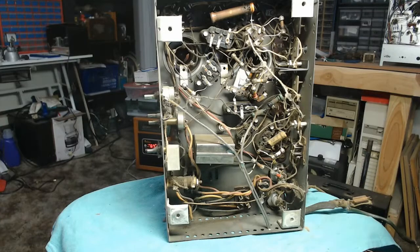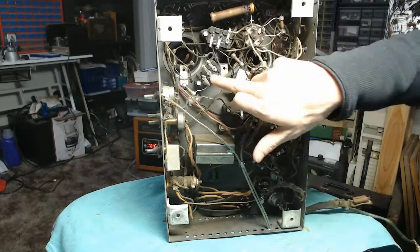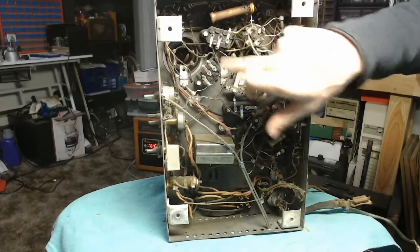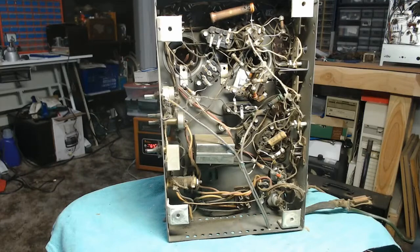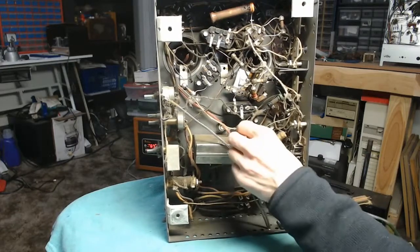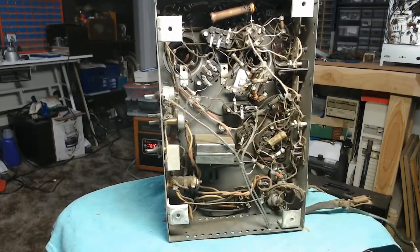There's a power resistor right there. All of these Bakelite blocks have capacitors in them, and we're going to have to open those up, scoop the guts out, put new stuff in there, and then just solder them to the inside. Apparently it's not that big of a deal. And then of course we have this arrangement with the braided wiring — I really don't know what's up with that, but my radio guide does have a diagram for this with part number references.